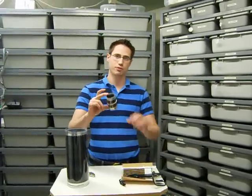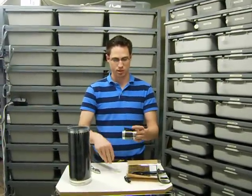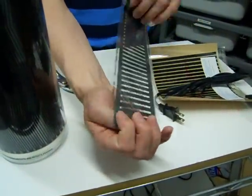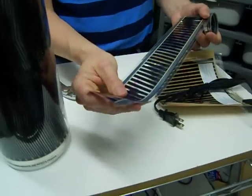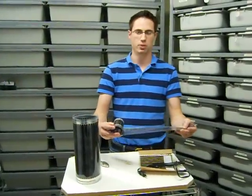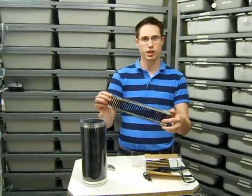Generally there is a 3-inch FlexWatt, a 4-inch FlexWatt, and then there's the 11-inch. These are more for a rack system — you can put these on the backs of the tubs. Let me roll it out here to show you. Essentially there are two sides through which the current flows, and it heats up the black part in the middle to warm your animal. It's a very safe product, completely encapsulated in plastic so it won't shock anything. You can buy it at any size roll you want — it's purchased by the foot. This here is a 6-watt, 3-inch FlexWatt.